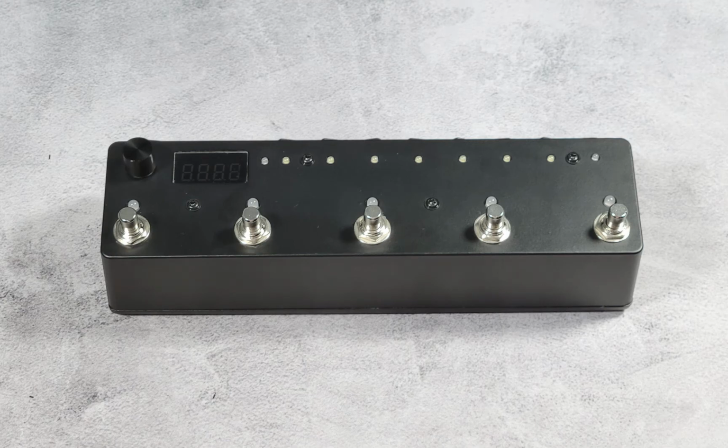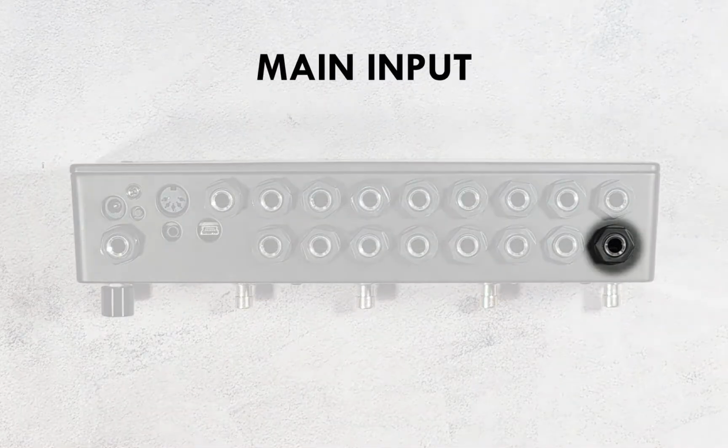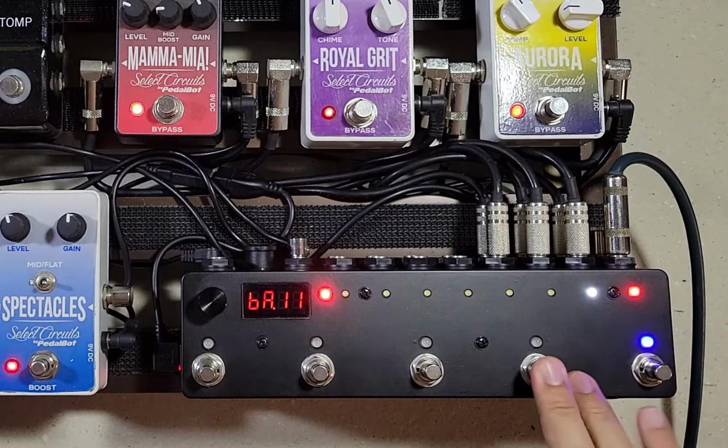The PB-M5-L7 is an integrated true bypass switcher and MIDI foot controller. It has 7 loops connected in series and has a fixed order. Each loop is bypassed using mechanical relays, ensuring clean and uncolored bypass tone. A buffer just after the input improves the input signal's integrity before sending the signal to the external effects. A muting circuit can be enabled to prevent switch popping inherent to mechanical relays.